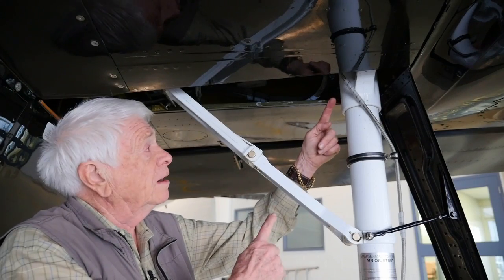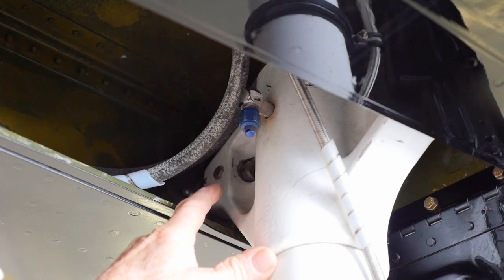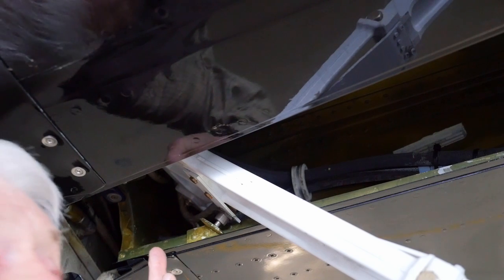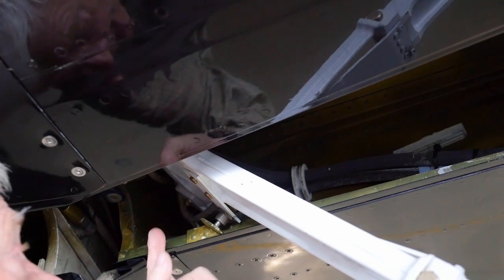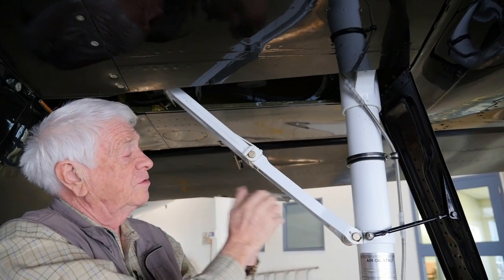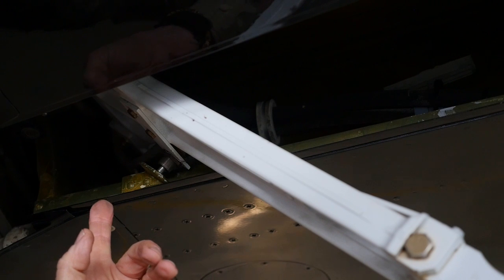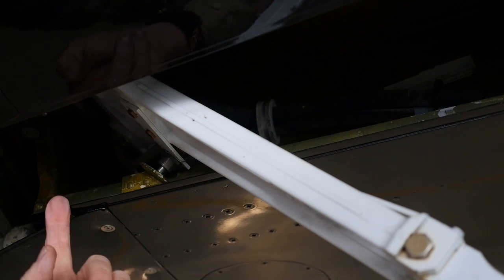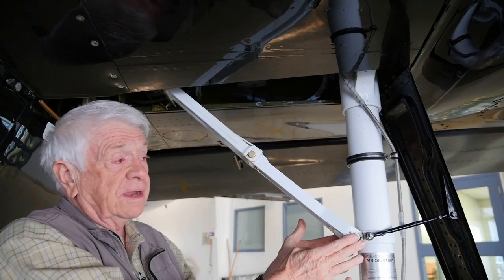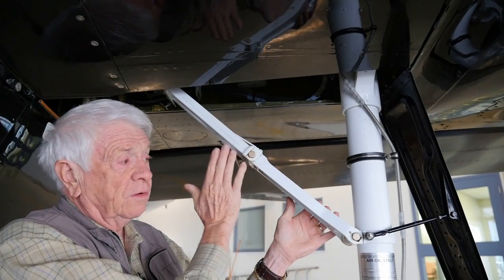The upper part of the landing gear has trunnion bearings at the top of the main landing gear leg. There are also trunnion bearings for the drag brace up in the wing section. They're also Aerotuff and they never see any loading while there's motion — they only get loaded up when everything is static, so it's not as bad a location as you might think. Here we had to change the shape of the bearings because this is a highly loaded position where the drag link breaks at this position and where it's connected to the main oleo link. But again all these bearings are Aerotuff now and they're all doing well.